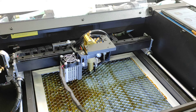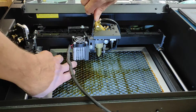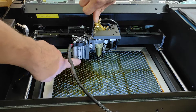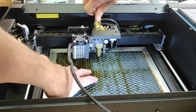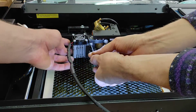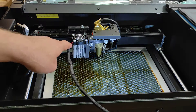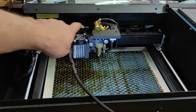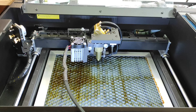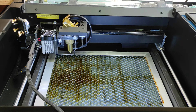We have one screw here that allows us to move it up and down, but we have a very limited range. That's why we're using a G2 short focal lens here. You can actually remove this cell and add a different lens. The good thing is that you don't need to remove the laser once you stop working with it, because the CO2 laser beam will not be hitting our diode laser.